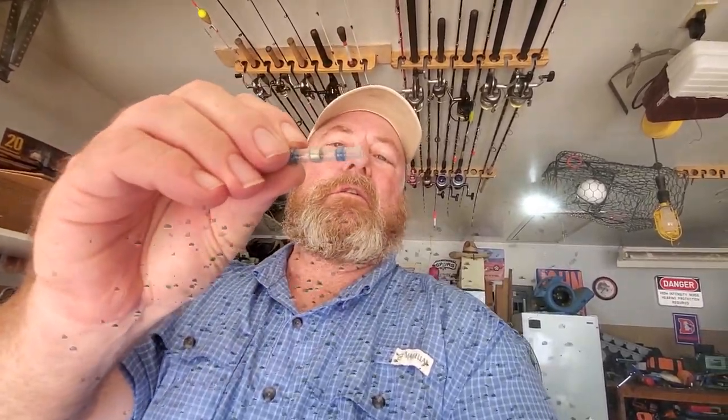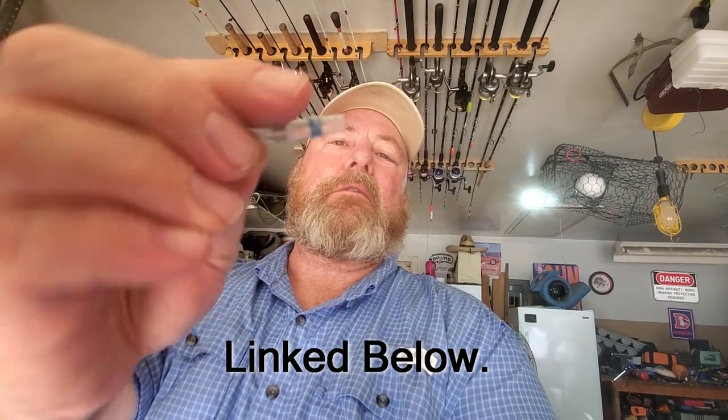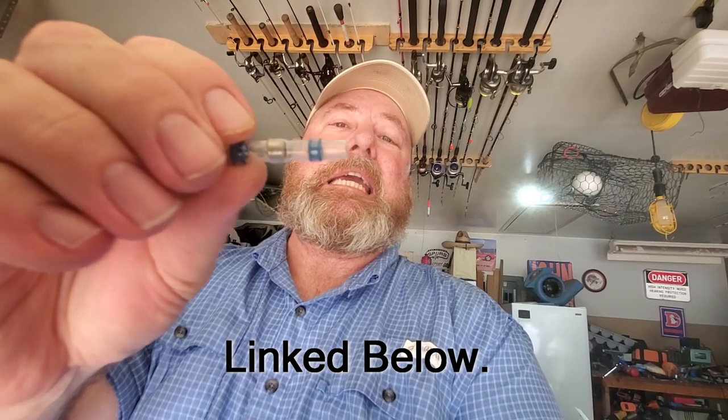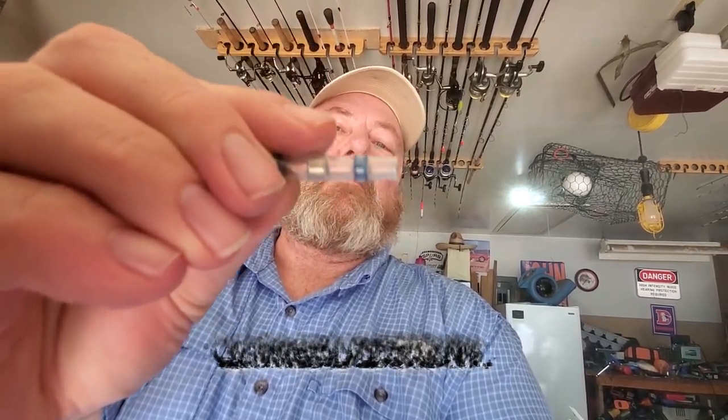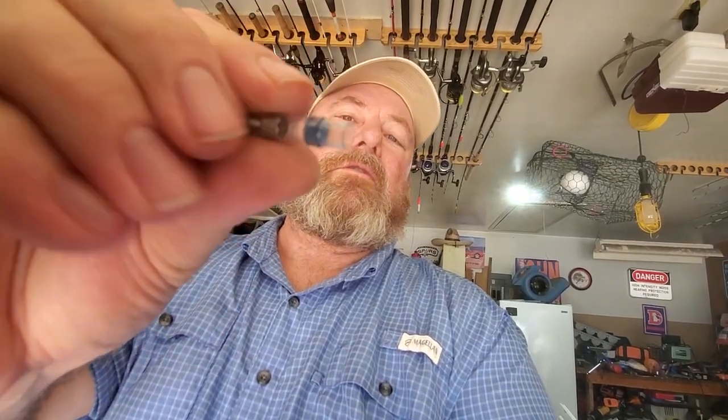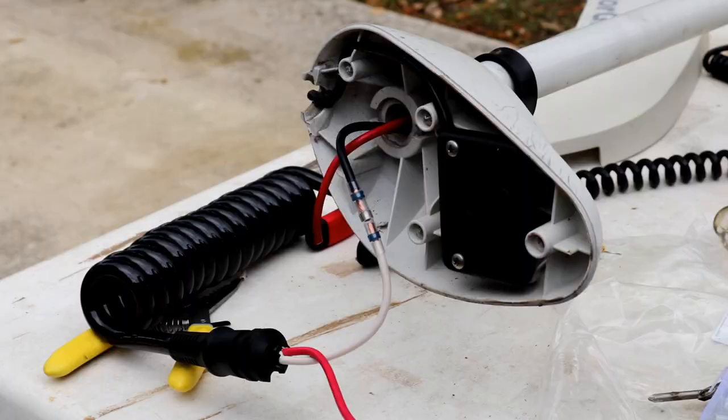So at the head of the unit, I'm going to be attaching those wires for the power cord with these bad boys, okay? This is that heat shrink material. I've been saying heat tape or shrink tape or whatever, but it's heat shrink. And the middle is actually a low temperature solder. So when you put this on there and you heat it, you not only melt this to it, but that solder melts onto the wires and you get a good solder. And it's going to be sealed, so no corrosion gets in there. So that's what you're going to see me use, attaching those wires on the curly cable to the head unit.